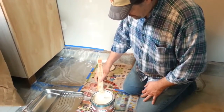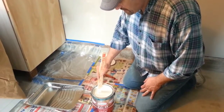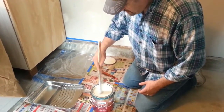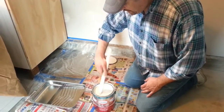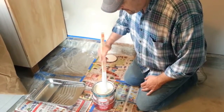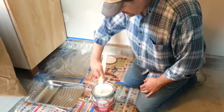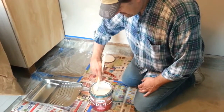You've got a stir stick, free from the store. When you do it, do it slowly. Don't get in there and try to mix it like a blender or something. As you're mixing, make sure you bring the stick up and down so that you're actually getting all the way down to the bottom, bringing what's down at the bottom up to the top. Vary how you do it. Don't do it all in one direction, and try not to make a mess out of it.